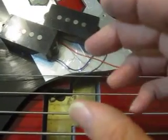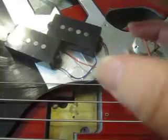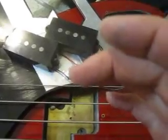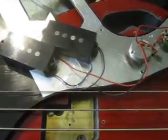I think I'll need the whole 1/2 inch. If you can actually trim the foam so that it naturally has the arc of the fretboard on it, then when you mount the pickups on there, if they're just a little bit high, you just compress the foam enough to get your pickup height right, and you've got just the right amount of dampening on the pickups.